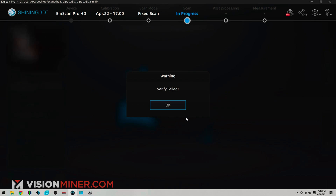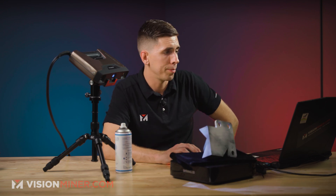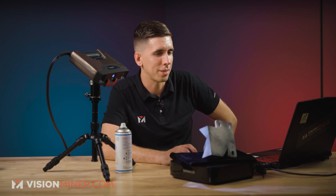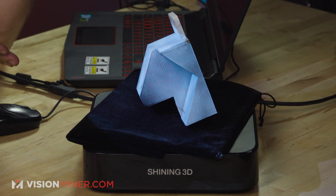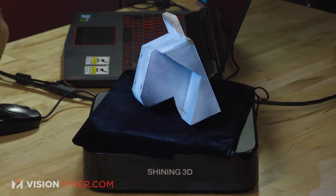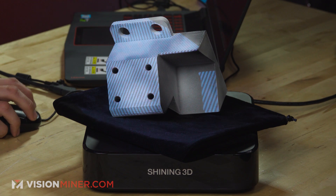The verify failed again. So that tells me it needs a different angle to start on to verify. I'm just going to turn it around like that and hit go. It's that big flat surface. I need to get a little closer but we'll see if this works. My scan isn't capturing the very top of the part and it's capturing a little more of the turntable than I need. I could get a little closer, maybe a little higher, angle it slightly differently to get more of the part, but it should still work pretty well.